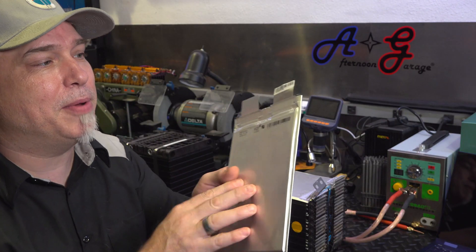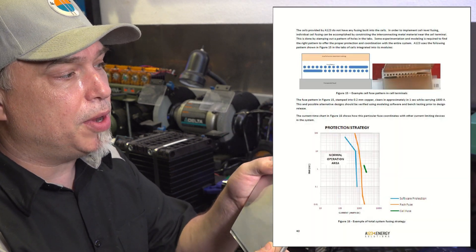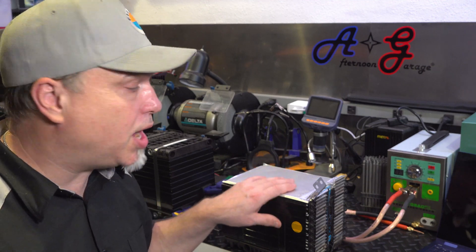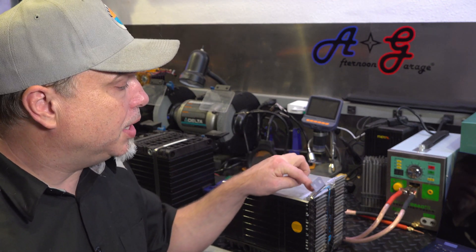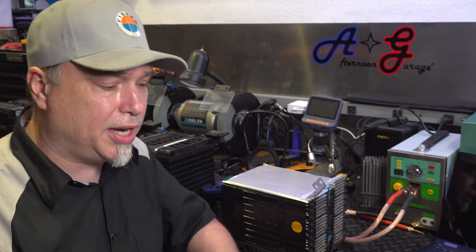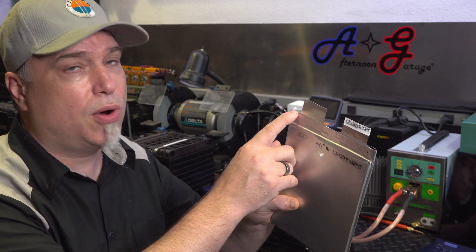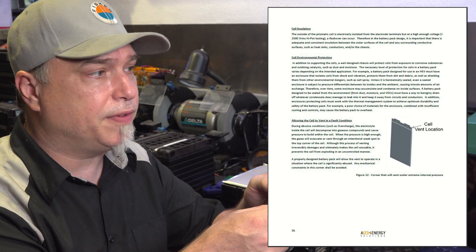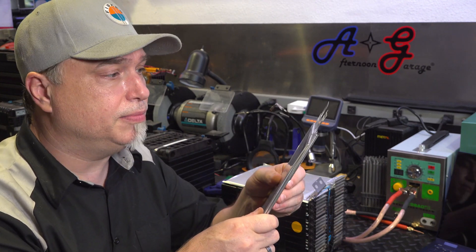Another thing to talk about: these A123 batteries we got have solid tabs on them. Now if you look at the application guide for the A123 Amp20 cell, you can see it has perforated holes in it, as does this Fisker battery module. I think that's so in case the battery shorts out it'll blow out the holes in the tab and disconnect. There's also a hole in the corner that will relieve pressure and make the battery inert if it overcharges or gets hot. The nice thing about lithium iron phosphate is that these batteries are really safe — you can put them in a car and they're not going to blow up on you.